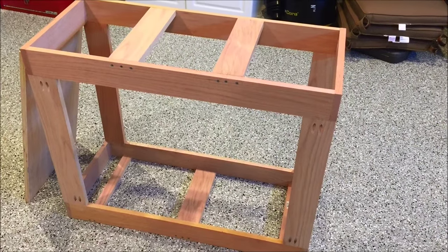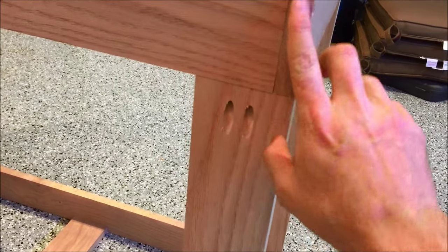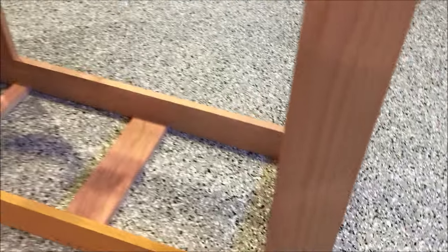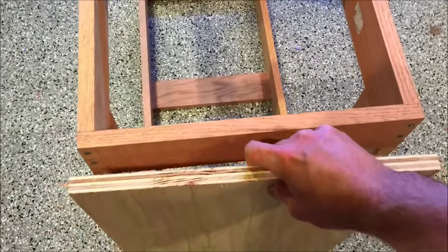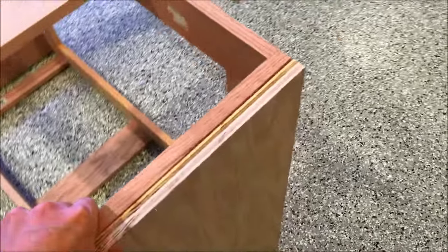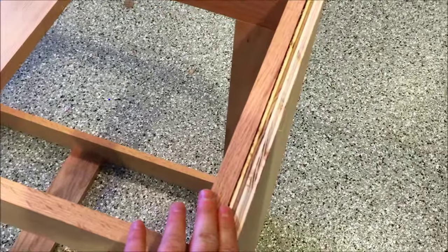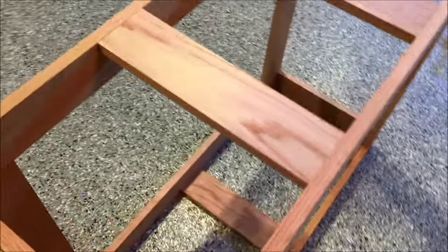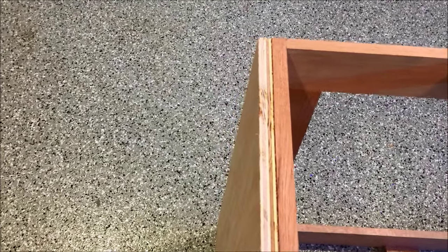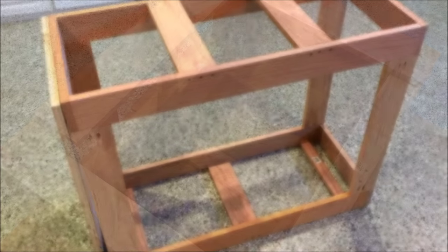Here's the frame all assembled. I've got the pocket holes going all the way to the edge, which will make it easy for attaching my paneling. Everything is transferring down through these oak legs, but that won't be the only support. I've now cut out the side panels on the table saw — I will glue and nail the plywood to the side, and the top will sit on top of this for extra support going down through the side panels as well. It's a little different than the other stand I built, where all support went through the frame and panels were just decoration — here I'm using the panels as additional support.